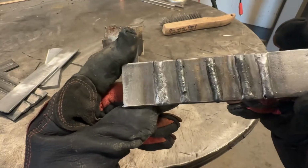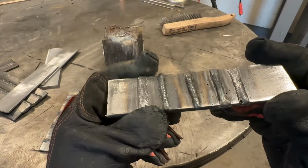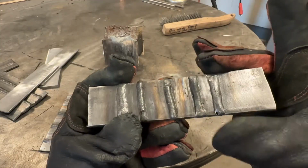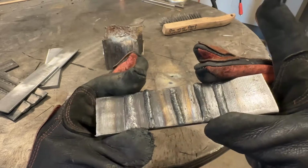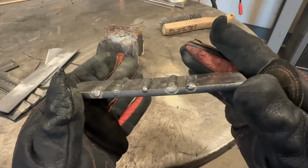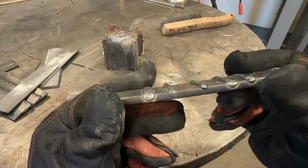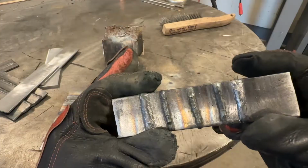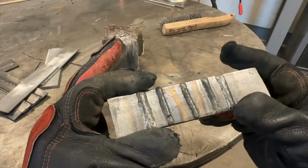Without question, we have deposited a wider, bigger weld than previous, because now our wire feed is higher than any setting here. Now this was our most recent one. You can see the bead appearance between these two is pretty similar. It's just that this weld is a little bit bigger. We don't have any evidence of porosity, which is good. This is a pretty happy equilibrium for weld size. On 1/4 inch, it's still a little bit on the small side for a fillet weld.